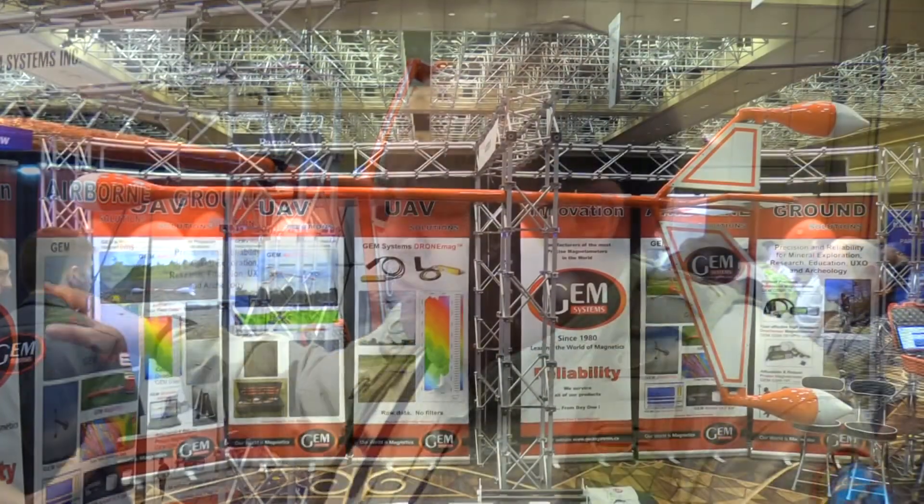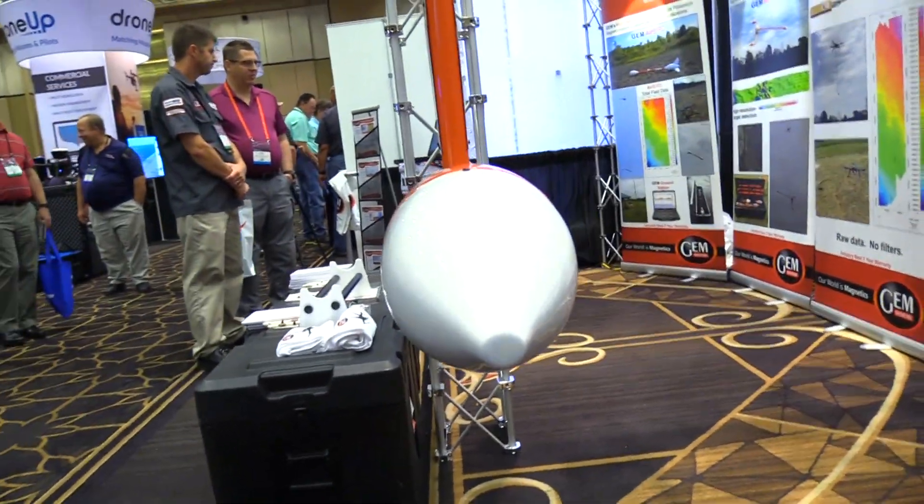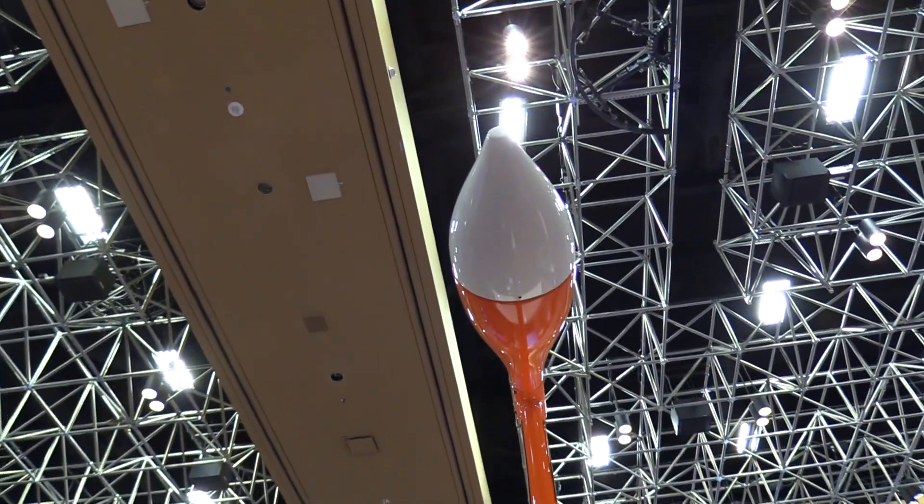The really large unit here is a gradiometer. How does that differ from the magnetometer? A gradiometer actually has two magnetometers affixed on it — mag 1 and mag 2 — and you're measuring the delta, or the change between the two, hence the name gradiometer. That allows you to pick up very small, minute changes, because you're measuring the actual change between the two sensors.